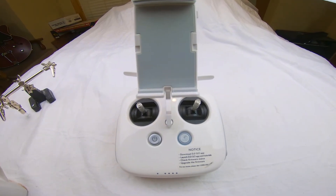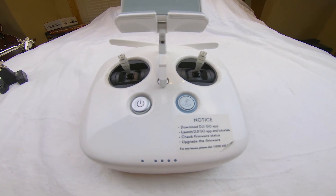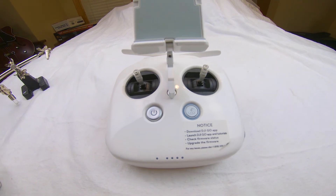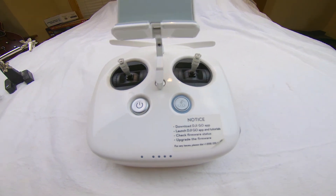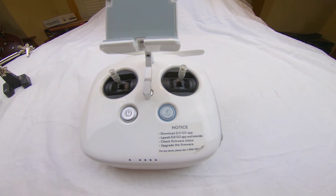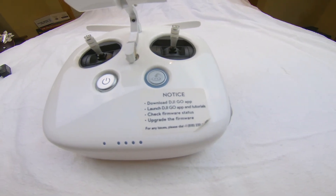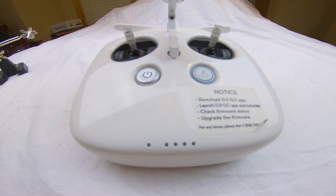Ladies and gentlemen, proudly presenting the completed project — and that was successful, I'm quite happy with that. What I did different this time is that part was baked with the reflow iron at 350 degrees for 35 seconds, keeping it focused on that part, no more than an inch off it. I came back, plugged it in, and we've got the magical four bars. This time it's fully charged. If that chip is indeed the problem — and I would assume it is — it's probably reporting the wrong voltage to the system.